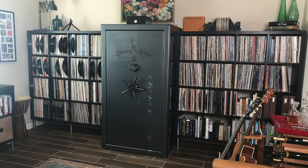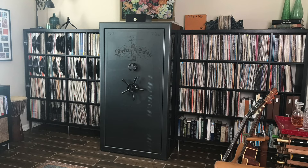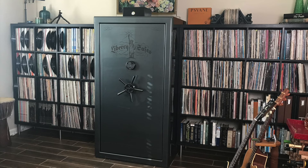Our second helpful hint: using adjustable feet will allow you to get the Kallax unit up off of the ground. This is great for not having to bend over so far to get to the bottom shelves. But more importantly, it gets you just above your baseboard, which allows you to put the back of the unit flush up against the wall. That provides much greater stability — so that's a critical one.